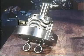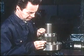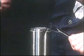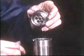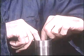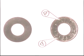When overhauling the suction valve, the top cover is clamped in the vise and the pinion nut for the adjusting device is screwed off. Undo the locking plate and screw off the spring retainer. Take out the spring and valve disc and check the disc. A valve disc whose seat is damaged cannot be ground but must be replaced by a new disc.